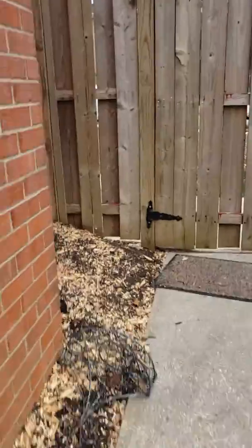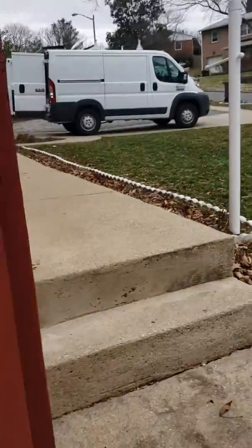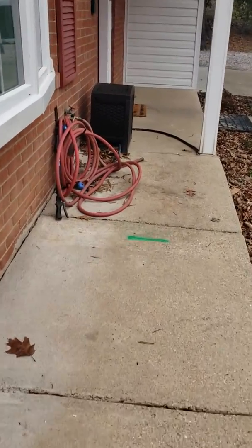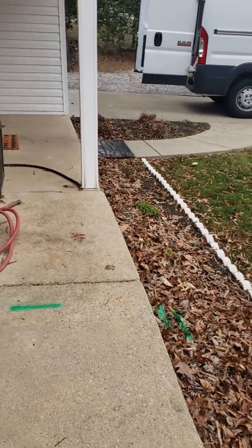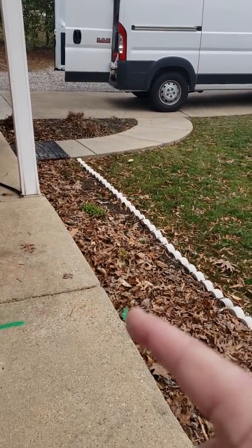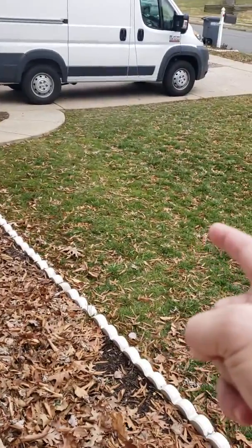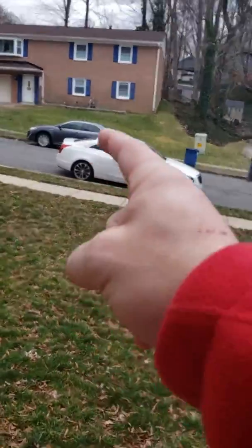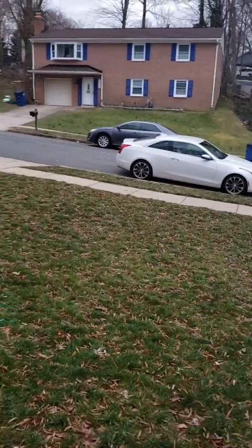We're going to come this way — the sewer comes out the front of the house. Up top here it's 11 feet deep. We're going to have to take out this section and that section of walkway. The hole in the pipe is right here, and the pipe is good for about one foot, then it holds the belly again. Since we're going to be digging here and all the way back to about here anyway, we've only got about another three feet to get to that. I'm also going to give them a secondary price to go from there to the sidewalk — not into the sidewalk, but to the sidewalk.